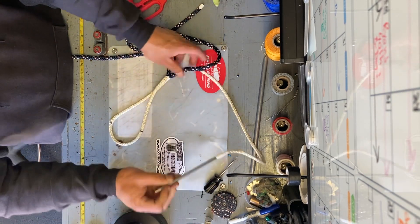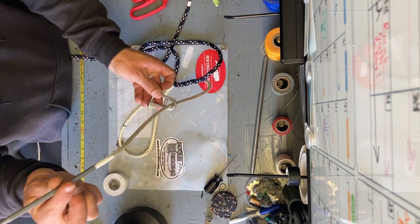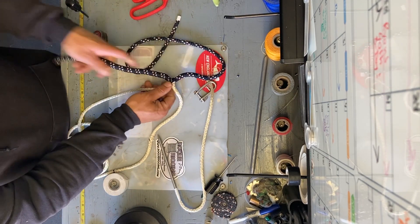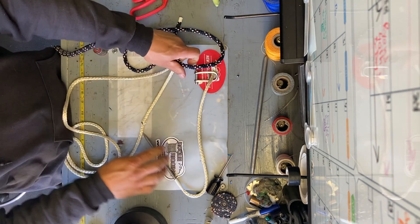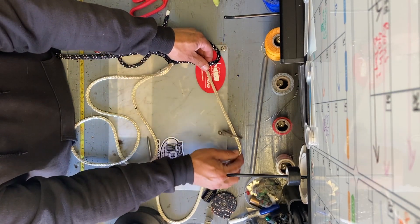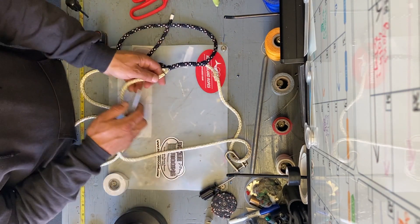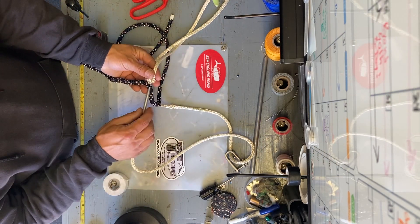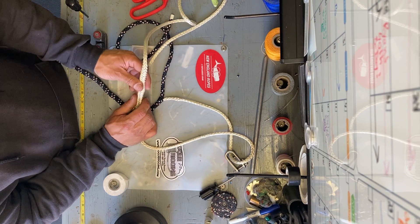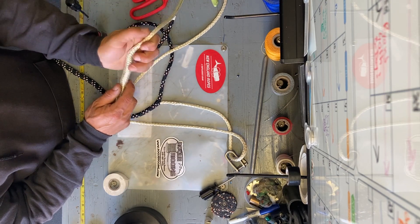Now we've got a loop here, and this is the important moment — put your shackle onto the fid just like that. Extract as much of the core as you can from the knot end of the line. Pull it so the large band we made lines all the way through. Then take the fid and slide it inside the cover. It's really easy to make a good line but really hard to make a good spliceable one — this VPC is awesome, very easy to splice.